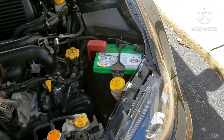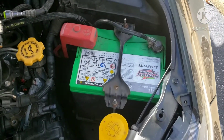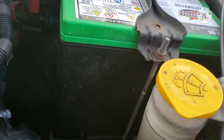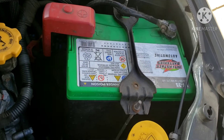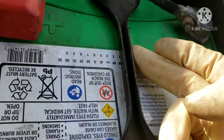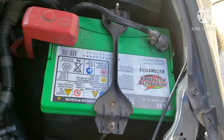We do plan on putting the battery in the stock location. However, we can't use the factory hold down for two reasons. One is there probably wouldn't be enough thread on our studs because the new battery is going to mount lower. And two, because of the restart button, this center bar here would interfere with the restart button, so we don't want that.